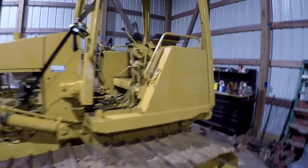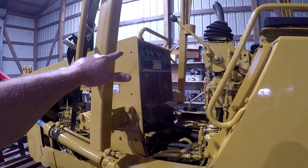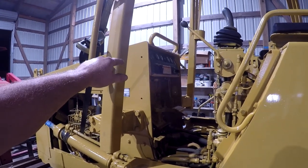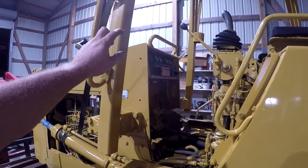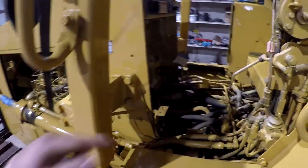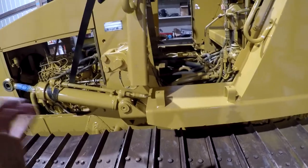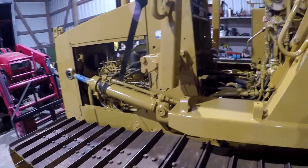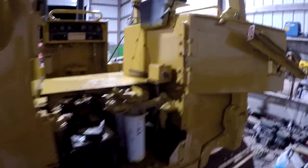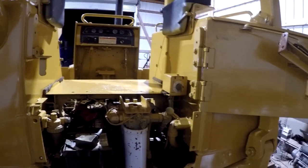I've got some new light bulbs for the dash and a new fuel gauge. I tested the fuel gauge and it did not work, so I ordered a new one along with some new LED bulbs for the gauges in the dash. I've also got a hydraulic line down here that's leaking — I think it's the fitting, an O-ring boss to O-ring face seal fitting. No idea where I'd go to get one of those locally, but I'm sure it'll be fun to find. I might have to drive somewhere since I don't have a normal hydraulic shop real local to me.